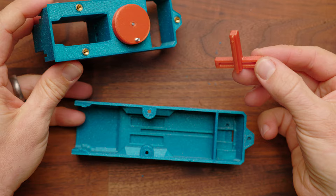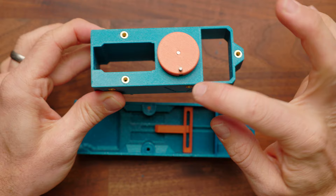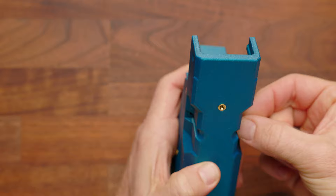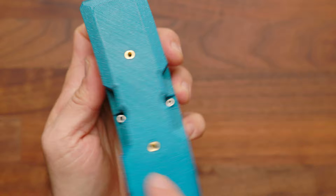Take your pusher and drop it in the slot. Put it somewhere in the middle, and line up the peg with the slot, ensuring they are connected. After that, pull it all the way to the back, hold the whole assembly together, and put two 10mm screws in those two holes — those are the medium-sized M3 by 10mm screws. After those two are installed, do one more same-size 10mm screw in the back.